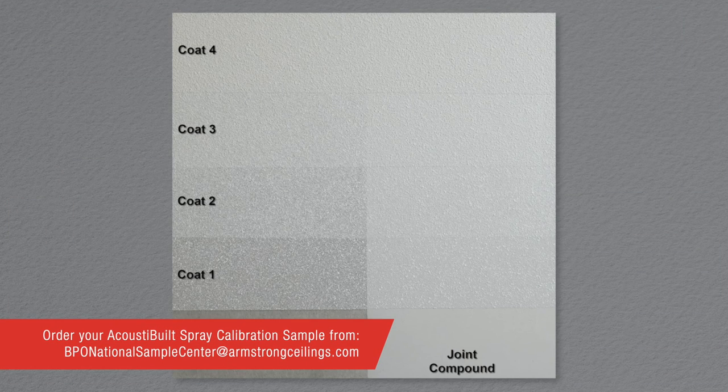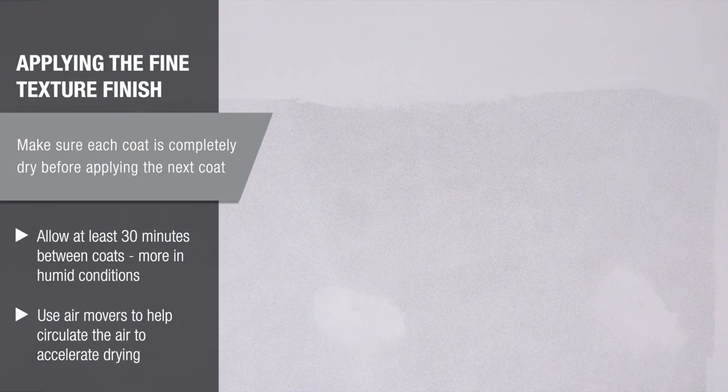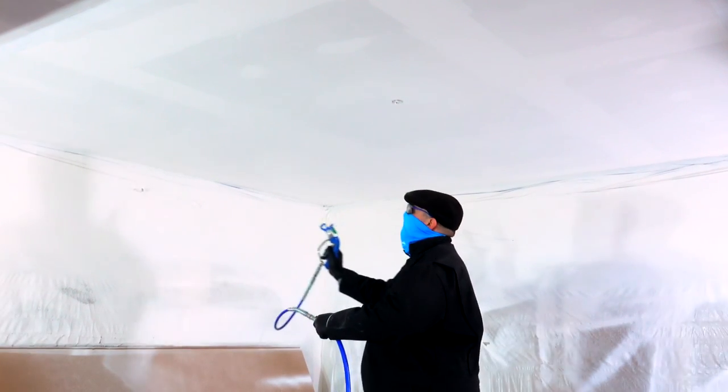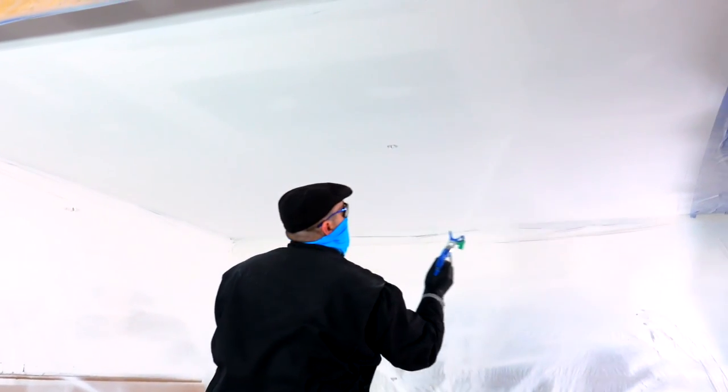Compare the coverage to your calibration sample after each coat. With proper application, the joint compound will gradually disappear by the 4th or 5th coat. Allow at least 30 minutes for drying between coats, and allow more time in humid conditions. Use air movers to help circulate air and accelerate drying. Alternate spray directions for each coat. Remember to check your spray pattern each time before spraying the ceiling, and assess the appearance with direct and side lighting after each coat has dried. After the second coat and the final coat, use a knock-down trowel or 220 grit sandpaper to brush off any loose texture.